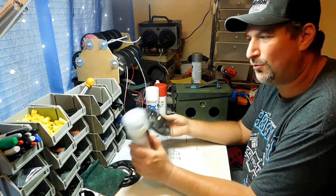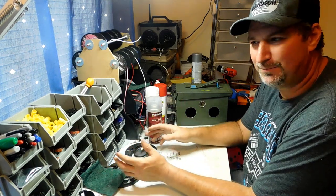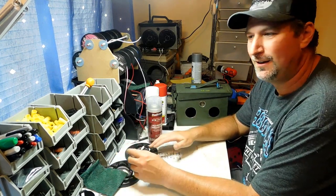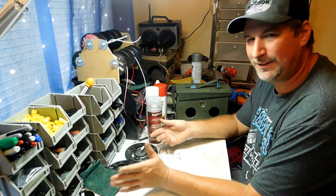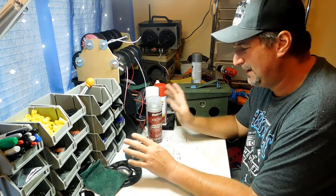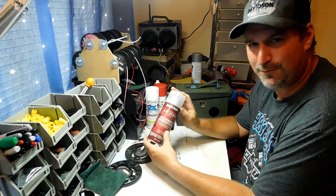You may have to worry about it, but watch the humidity. Number one is, if it's raining outside and you're going to paint your garage or something, I really advise against painting whatsoever. You don't want the humidity that high. Or if it's you guys on the West Coast, San Francisco, if the fog rolls in that morning, I really advise against you painting at 100% humidity, because this is not going to evaporate well enough, and you're going to have moisture that'll get in your paint, and you're going to have a bad paint job.